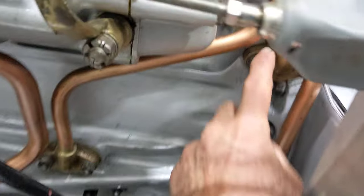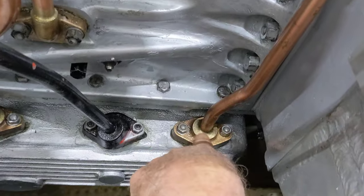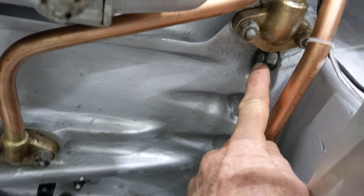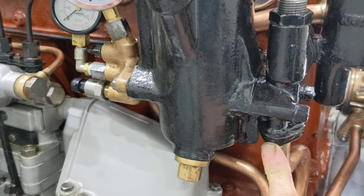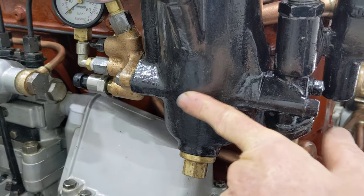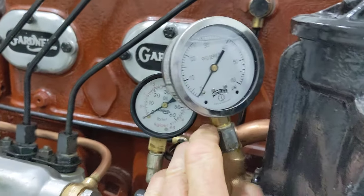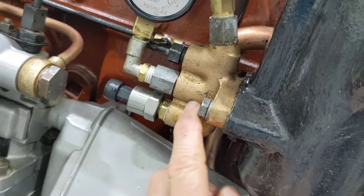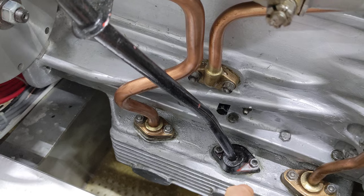This is where the oil comes out from the oil pump. The oil pump is immersed in oil down inside the oil sump, then goes up into a drilled passage, comes out into this pipe, goes all the way up here and into the PRV — the pressure relief valve. Most of that oil goes under pressure into the filter, through the filter out this side, and that's where our pressure gauges are, giving us the first reading on the pressure in the system. Then once that oil gets into this junction box it comes down this pipe, goes back down, and feeds into the pipework system on the bottom of the crankshaft main bearings.